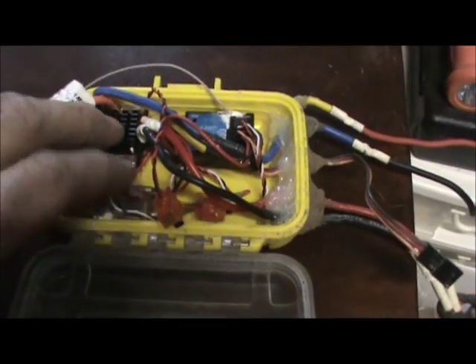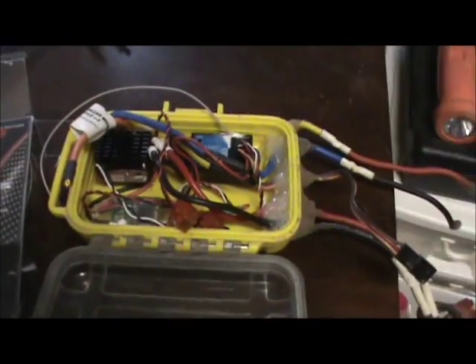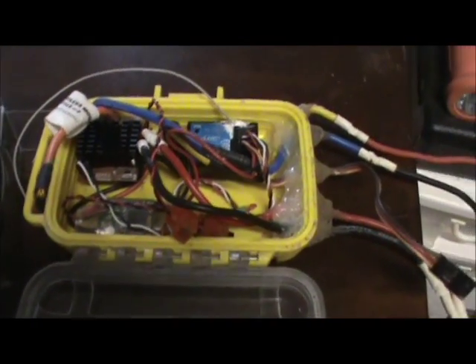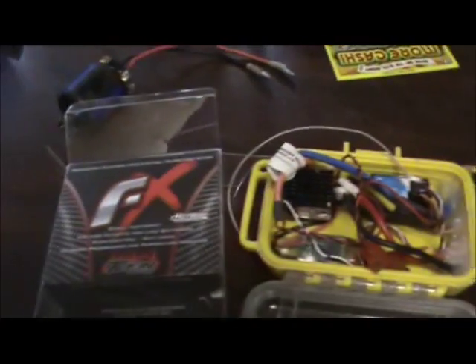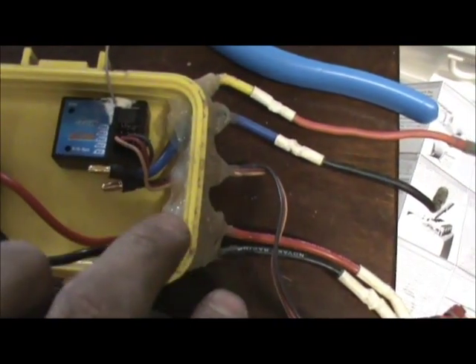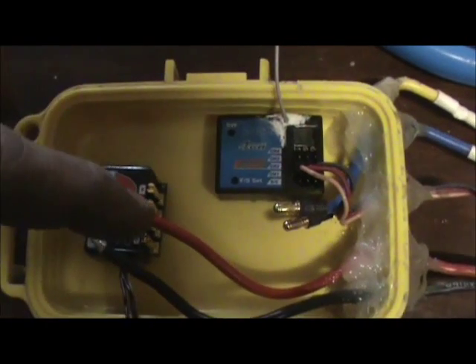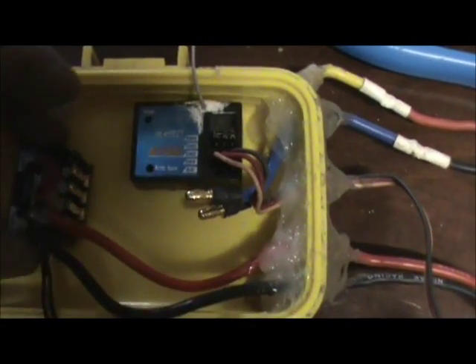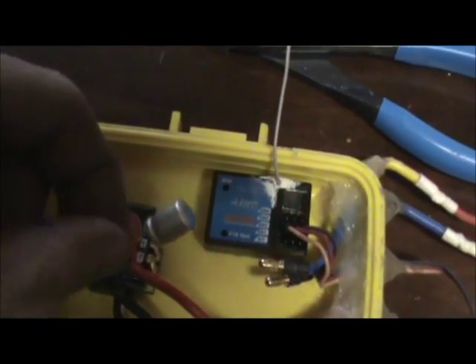What I'm doing today is getting this mess out of my electronics box and soldering up this new ESC to get it all hooked up. There's a whole programming sequence you have to go through before you can run anything. Now these are my battery lines — as you can see they're all siliconed in this box, and I'd really rather not undo and redo that. So I think I'm going to mount this ESC about here so my battery wires will reach and I can solder them in right here in the box. I also have this capacitor that has to be soldered in junction with that.